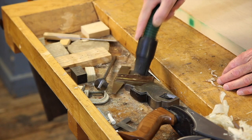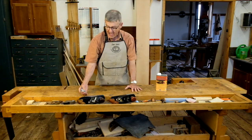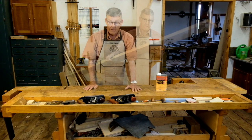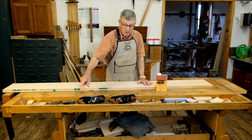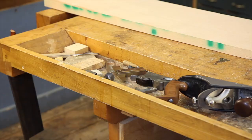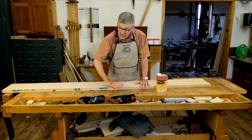When you try to vacuum those chips out, you end up sucking up valuable little bits and pieces that you have to go and open up the vacuum and go fishing for. Therefore, I'm going to route out a ledge all the way around this tool well and put this piece of European beech down in the rabbet and glue it in place and level that out with the rest of the bench.